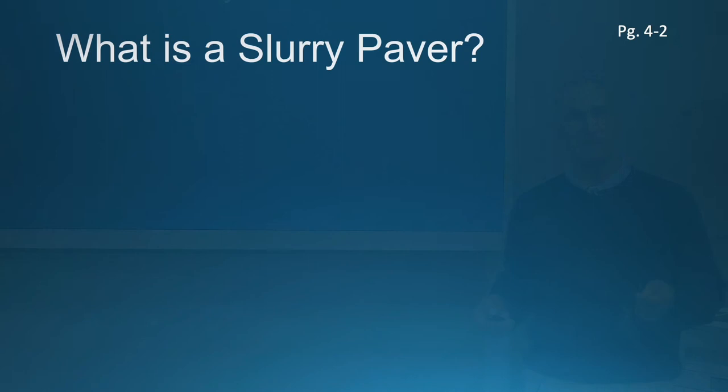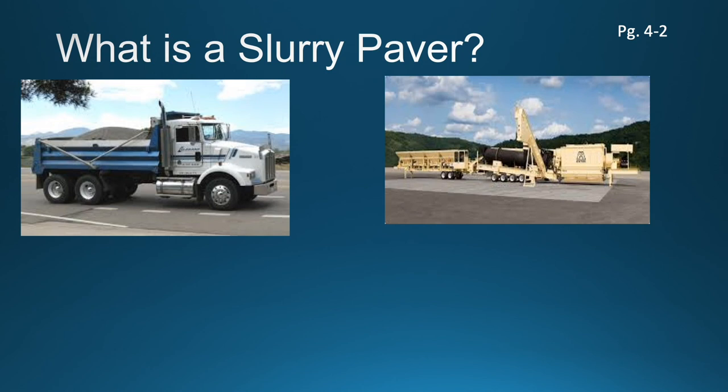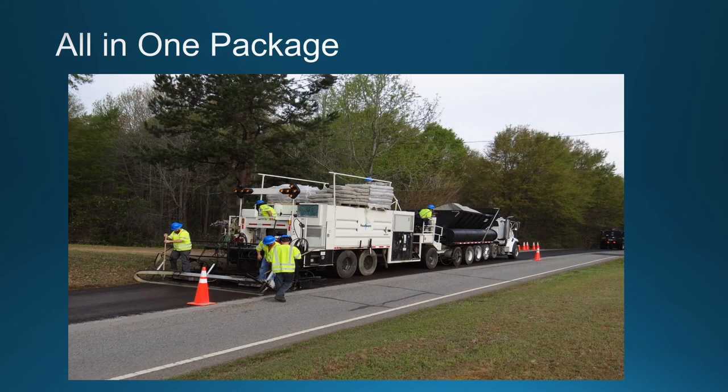So what is a slurry paver? What is a slurry surfacing machine? It's a transport vehicle — a piece of equipment that hauls aggregate, like a dump truck. It's a portable asphalt plant; we're taking all these raw materials to a site and mixing and laying them on site, so it's a portable type of batch plant. It also mixes and applies the material, so it's really a paver itself. Although we don't necessarily utilize a compaction tool or roller in any of these slurry surfacing materials except in very few isolated spots, it too will function as its own compaction equipment. It's all of these things in one package, delivering all of the raw materials to a paving piece of equipment and mixing and laying as the machine moves down the road.